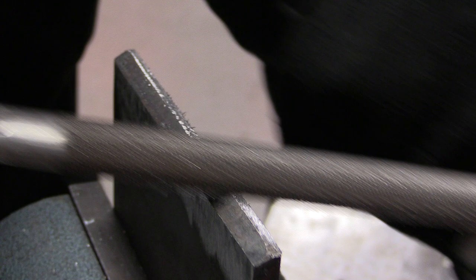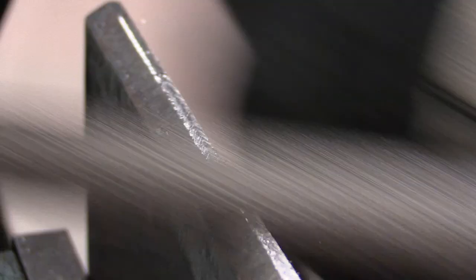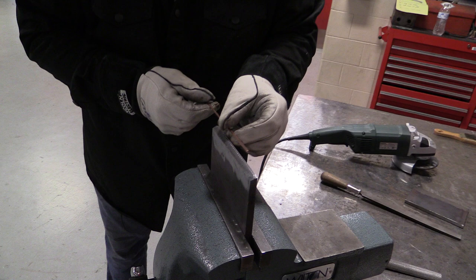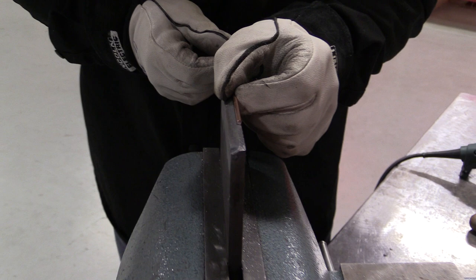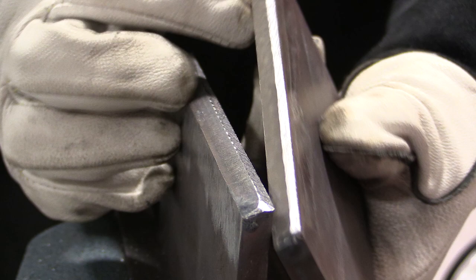X patterns are what makes things flat. We're cutting back and forth across there — X pattern back and forth. It doesn't take that much time. You can start to see the grinder marks go away and the little X patterns forming in there. Now if I look at that, I take my 1/8 inch filler rod and lay it right on there, and I can check this thing all the way down. It's pretty nice — that's about 1/8 of an inch.